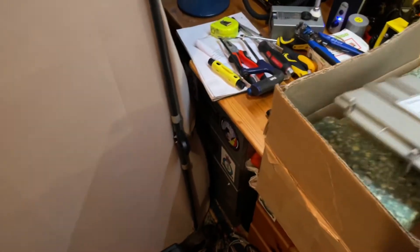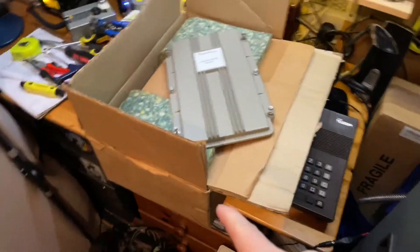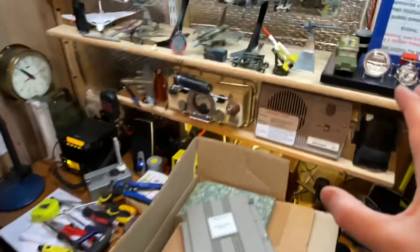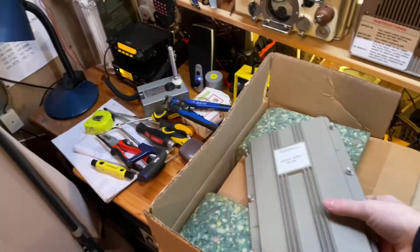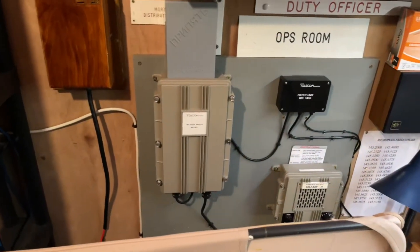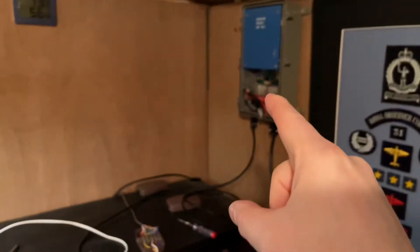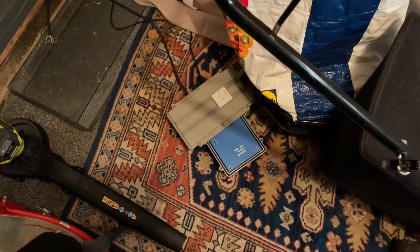I'm quite lucky — over the years I've collected lots of these speech receivers. That's a brand new one I had in a box, and that's the one up on the wall there now. These are supposed to use the WB-1400, but as you'll see, this is a WB-1401. The WB-1401 is what's supposed to be used with the metal, ruggedized speakers, and the WB-1400 is supposed to be used with the plastic speaker — so I have my WB-1400 down there.